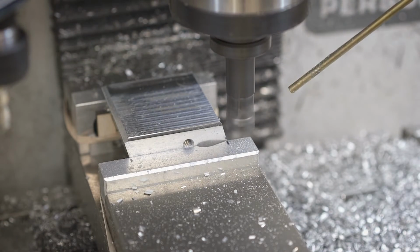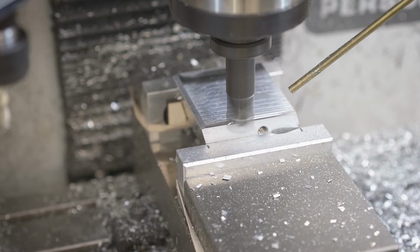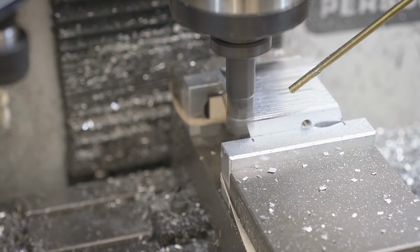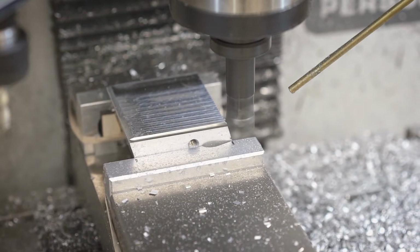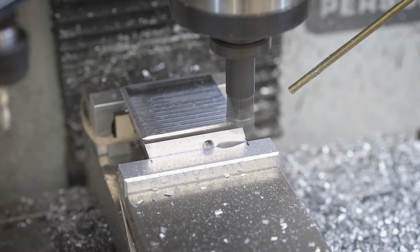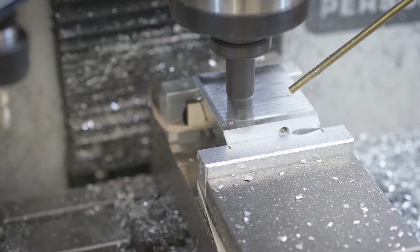Once the bulk of the material was removed, I needed to get it down to where there was no angle or lip, I guess, on that left-hand side. So I just kind of adjusted it 10 thou at a time, made one quick cut, and then did that cut until that line went away. And then when that line went away, I just did the whole facing operation. And then I set this program, saved it, and then ran it on the second part.